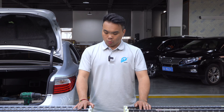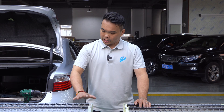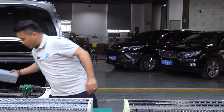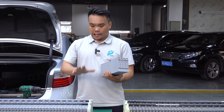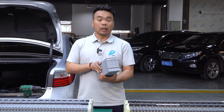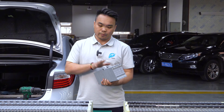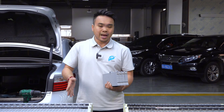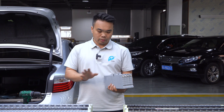There are two options when selling the battery: they either come pre-assembled or they come separate in individual cells. Keep in mind, each pack or cells delivered together need to be used together. You cannot separate them because they're balanced and matched. If you start to mix and match different battery packs, it's not good for the car or the battery — we try to avoid that.